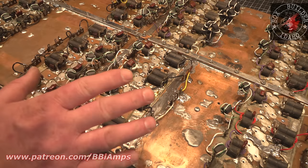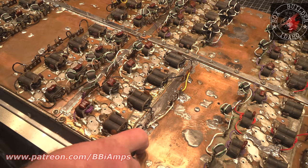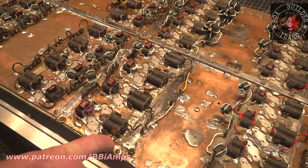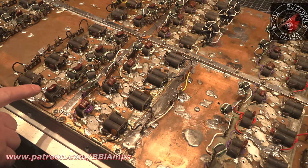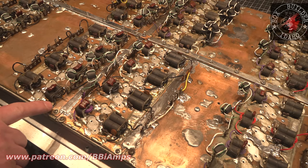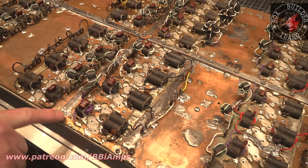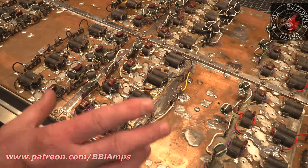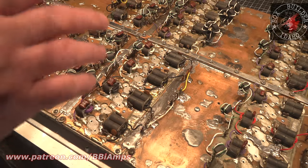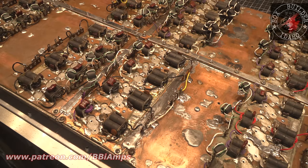Also, got to remember, we're dealing with RF, so we got to make sure that, as far as the RF signal is concerned, this and this are the same electrical potential. Imagine that. Otherwise, the RF is going to think, oh, okay, we've got our nice ground bed. Oh, now for me to get ground, I've got to go all the way over here before I can come back this direction. It's the same thing with bonding in your vehicle. There's a reason that we bond all the panels, because we want as much surface area to be at the same electrical potential and not all spread out.